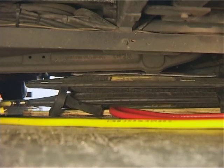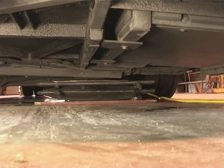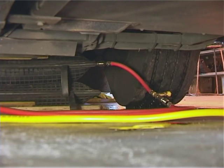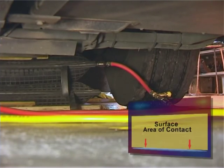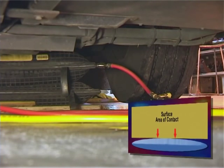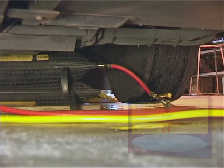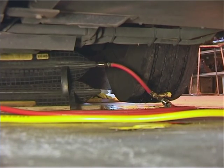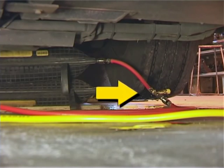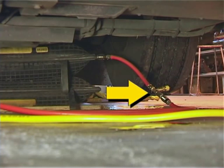When using two stacked bags, inflate the bottom bag first as a foundation, and then inflate the top bag. Remembering that the bag's lifting ability reduces as the bag inflates and the contact area with the load surface is reduced. If the load is greater than the lifting capacity of the bag, the safety shut off valve assembly or the pressure relief valve in the dual controller will begin to vent and lifting will cease. The airbag will remain at this level.